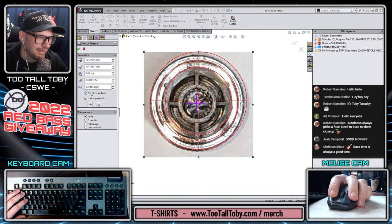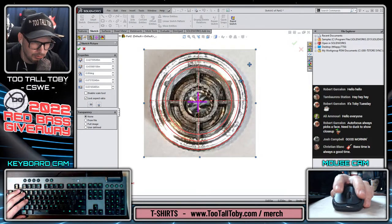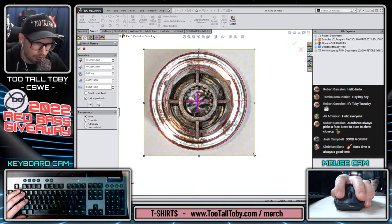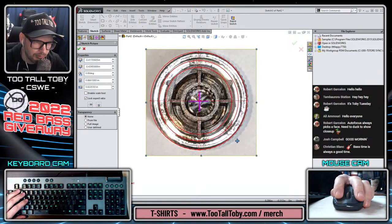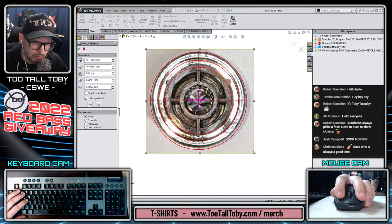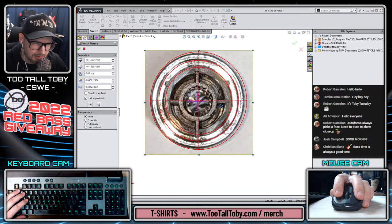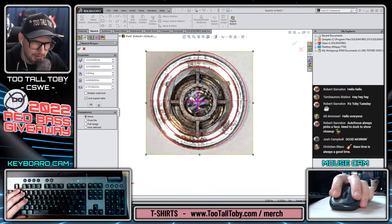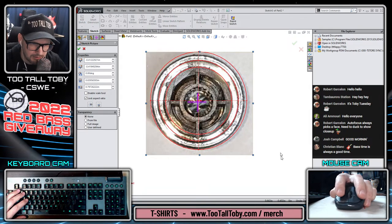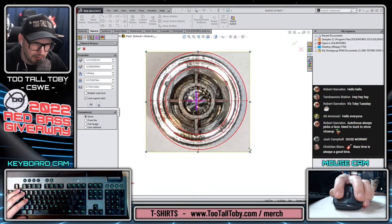But if you want to grab the corners here and resize by grabbing the corners, usually you can't do it when it says enable scale tool. I think because I unchecked it and checked it again, it gave me a little bit of slack there. But normally you would have to uncheck that option before you're going to be able to grab the corners and move the corners around. It's kind of interesting here that I'm getting some deformation or deviation in the photo. I'm going to chalk that up to me measuring to the knurls. And I'm going to focus a little bit more on the inside circles here, the circle for the plastic and the circle for the inside diameter there. I think that outside diameter maybe is a little bit off because of the knurling and depending on where I measured it. So I'm going to focus on the plastic circle. I feel like that one was a pretty clean dimension.